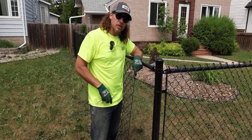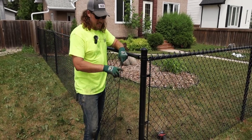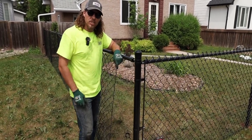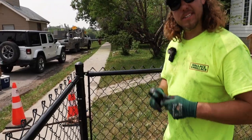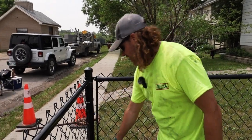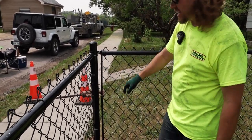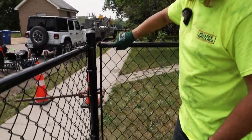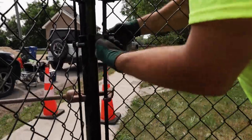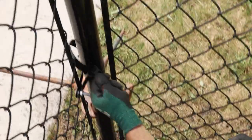In this instance, because we are working in a corner, what I am going to do this time — which I didn't do the first time — is hook up two pole jacks. The reason is I am the one doing the connection and I won't have access to the other side to remove the pole jack, so I am just going to start off with two. Because we do have bands here already, what I personally like to do is match the height of the band. So I don't necessarily go in that second diamond as you would before. Because this is the higher top rail, I am just going to go above this band — it happens to end up about two and a half diamonds down. Same thing for this one — final step, tighten them up.